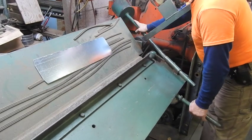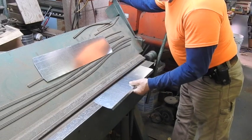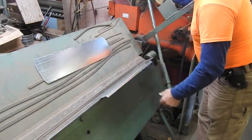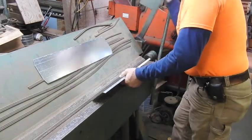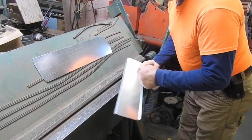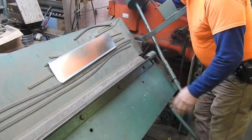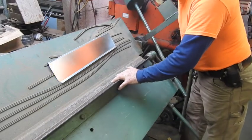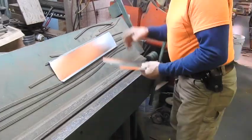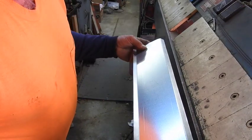Bring this up to 45 degrees — actually a little farther to account for springback. Turn it over, invert it again to the half-inch mark, go to 45 degrees again, a little bit beyond 45. Without the bending bar in the way it's much easier to get in and do what we need to do. These are not going to be 100% shut off — there's going to be a certain amount of leakage.